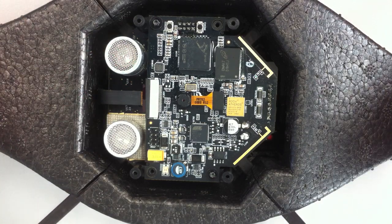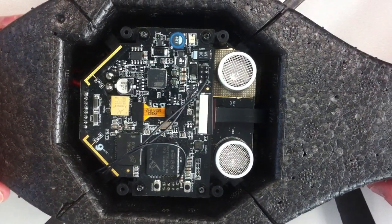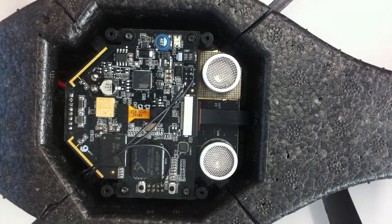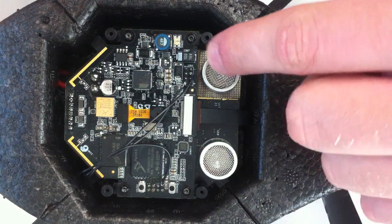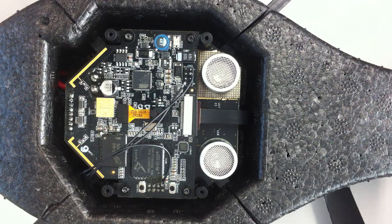Part of the issue with implementing these systems is that a lot of the time people implement the GPS by soldering it onto the outside pins. This is a mod I developed with a bit of research online and probing these pins and analyzing with my team. Essentially what this mod does is use 5V from the ultrasonic sensors, a TX pin, and a ground pin. There are instructions on what these pins do and how to get serial pass-through back to your computer.